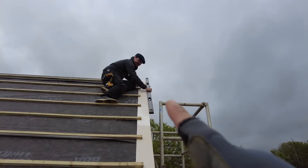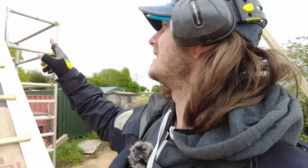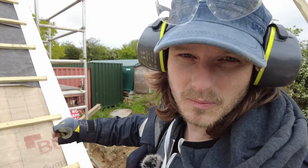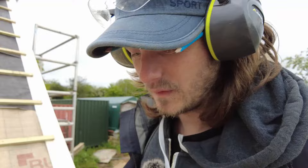Just double-checking it with a level — we could just measure off the top anyway but it's pretty square. It's never going to be exact because these boards are not perfectly cut, but it's there or thereabouts. That's pretty much how you do it. For the battens we've already put in, we're going to measure off a measuring tape to gauge them. The ones in between we just use little blocks and space it up so it doesn't go too skew up the roof.